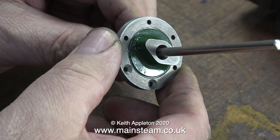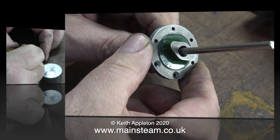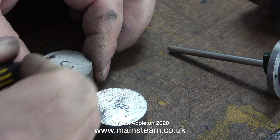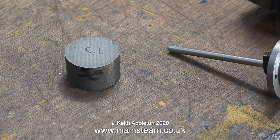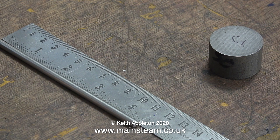Starting with the piston rod — this is what was in the kit, a piece of bar. Before I start properly, it's important to identify the pieces of metal in the kit. These two short lengths of metal bar look identical at first glance, but the one on the left is made from cast iron and the one on the right is steel. By checking the parts list on the drawing, you'll realize the steel is for the eccentric sheave and the cast iron is for the piston. As I'm making the piston in this episode, I need the cast iron, but first I'm going to cut the piston rod to the correct length.